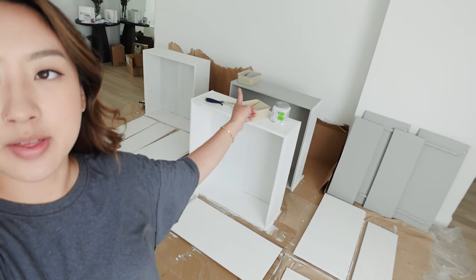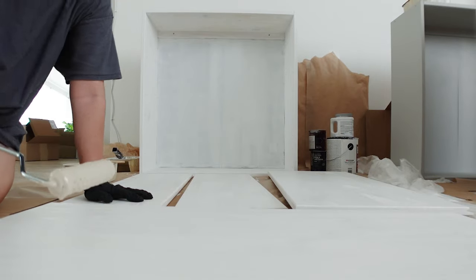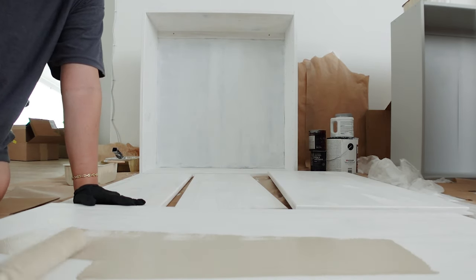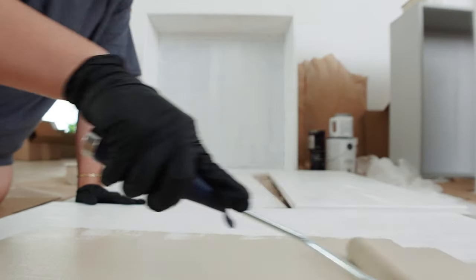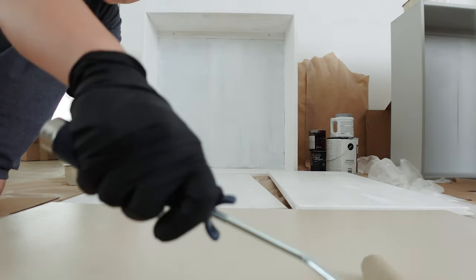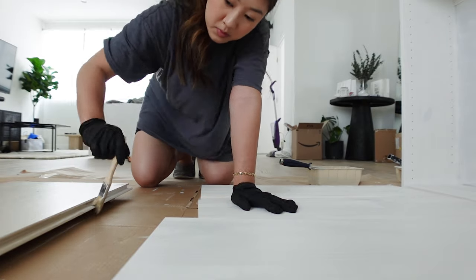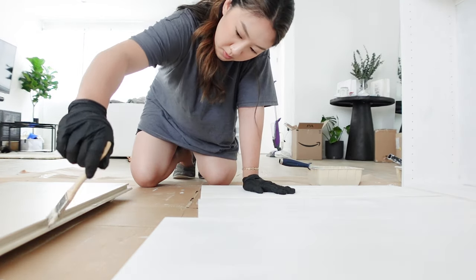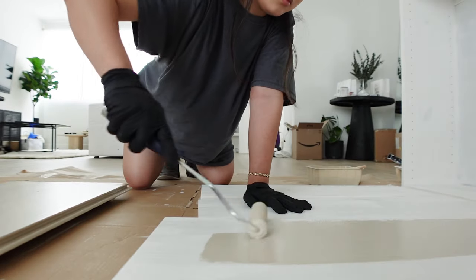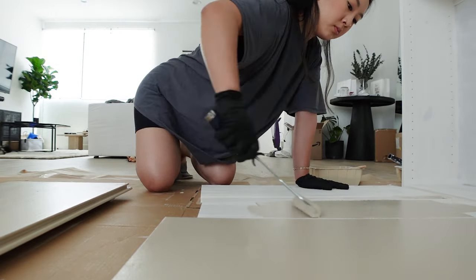Everything is primed except for that one, which is already painted in the color I don't want. I have a sample that's more of a beige, not as cool-toned. I got a $10 sample of Pavilion Beige from Sherwin Williams and used every single drop — it was the perfect amount of paint for all three cabinets. I'm going into the nitty-gritty with the chip brush. The reason to assemble before painting is because you have to wait for flat pieces to dry before flipping them. Once the paint dried, I applied two coats of polyurethane in a satin finish to seal the paint job and make the furniture more durable.